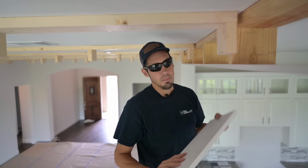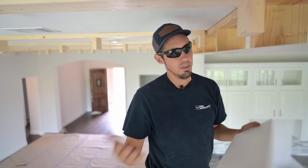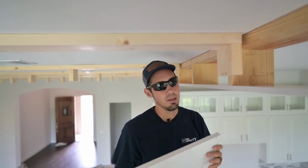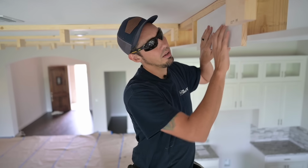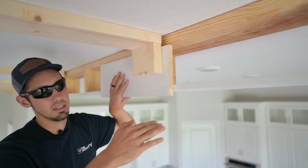If you do that, you're gonna have to deal with joists that are out of whack, and spaces in the ceiling that roll from those joists. The ceiling may look straight, but when you put a straight board on it over the span of 18 or 20 foot, you're gonna have some imperfections. What that would affect, if you did it that way, is you wouldn't be able to have a true 3/4 here. You would be at the mercy of the ceiling.